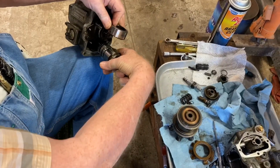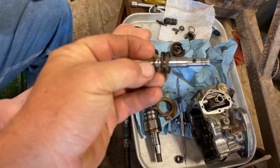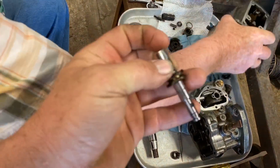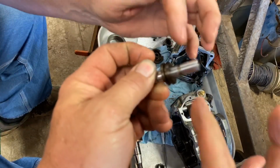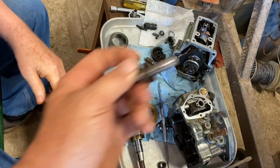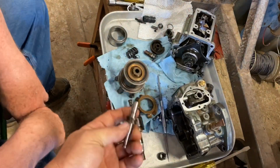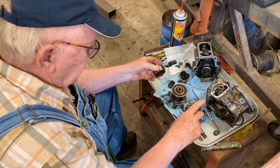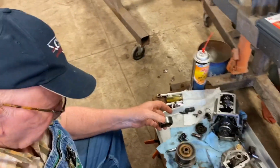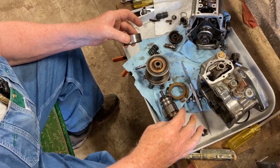So this thing's turning it. Turning this right here. No, that's not turning. That's all it tells, as that thing comes around. Actually, I got it upside down. That's all it tells every time it comes by that little slot. Fuel is coming in this notch right here. And it's going up and down. It just keeps going around that head. This has to rotate because the cam has lobes. There's three lobes, but there's six cylinders, six injectors. So this has to turn.